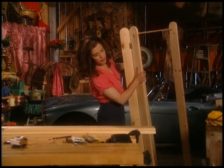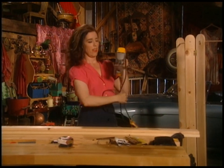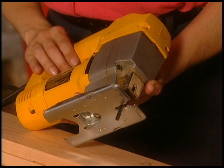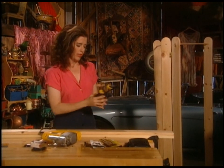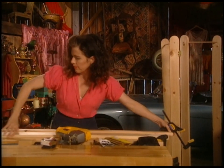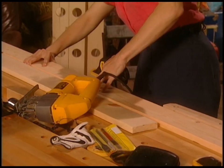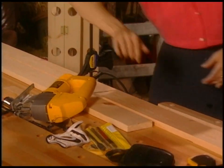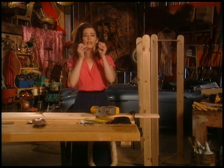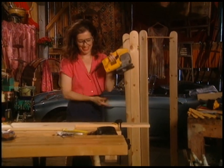With jigsaws — this is a great saw, actually — the little blade can cut through metal or wood. They give you variety. The first thing to do before you actually cut is to clamp the board down. You can do two at once if you're hot-dogging, but I'm just going to do one board at a time. Clamp that and give yourself enough room to maneuver your jigsaw. You want to wear safety glasses because the jigsaw throws up a rooster tail of sawdust.